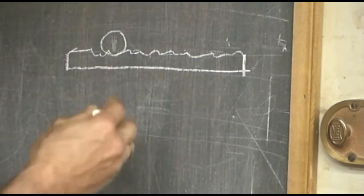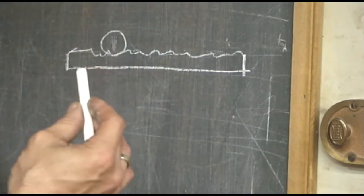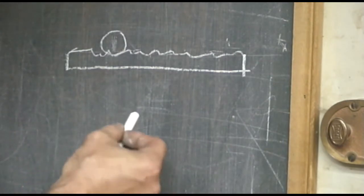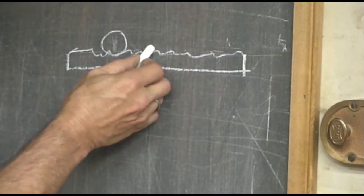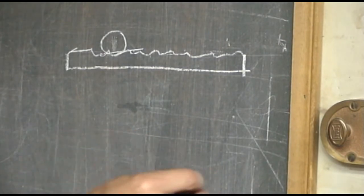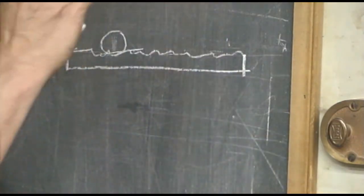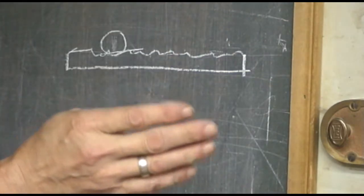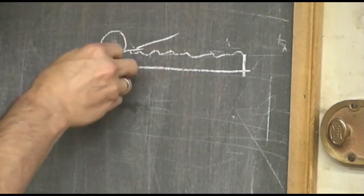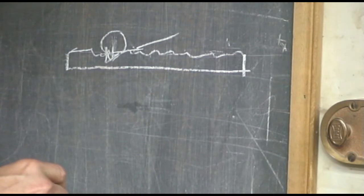What you're doing when you use either the tool that comes with the caliper, or if you make your own — I did it with a beer can before because I lost the tool — is you're sliding that tool between the gear and the rack. You're able to move the two parts of the caliper, get the dial to read zero, put it on a whole number like two or three, then pull that piece out. The gear will drop into the proper place, and when you close the caliper it's clocked back to the 12 o'clock position.